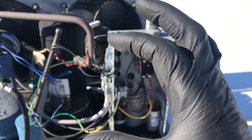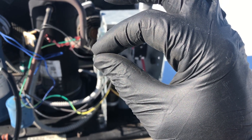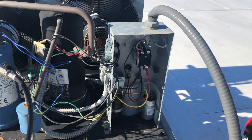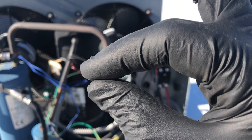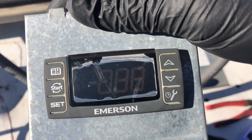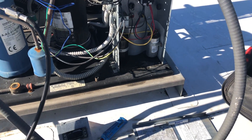High pressure is made, low pressure makes and breaks with the solenoid. The solenoid energizes, the pressure comes up, the low pressure switch will make — we're on. Gets satisfied at temperature, the solenoid closes, the unit pumps down, the low pressure switch opens. If our fans fail and we get high head for some reason, and that head pressure switch — the little green ball right there — gets too high, it's a normally closed switch — it opens, unit's off. Very simple. This thing was doing a good job monitoring it, and I have nothing bad to say about these. The installer didn't put a cover on this unit and water killed it — that thing didn't fail, it got killed by rain water.